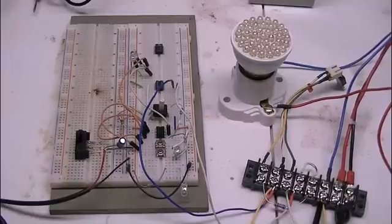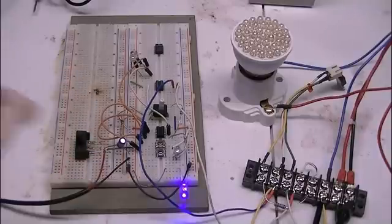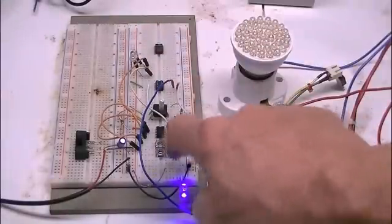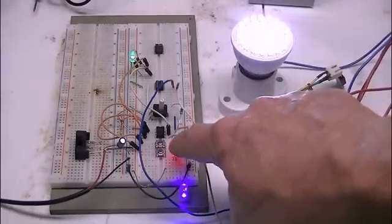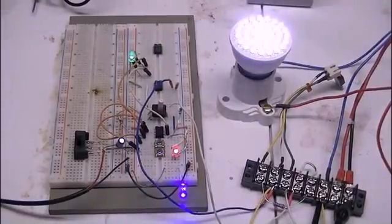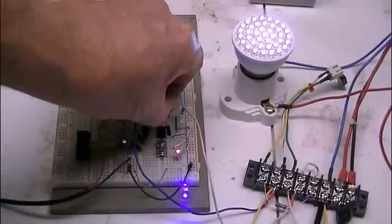Let's give this a little test run just to let you see what it can do. Power is on — you'll notice I've got a little UV LED down there. This is designed to later operate an H-bridge. If you look out here you'll see an LED come on. I'm reading an analog input channel and reading the value on this pot to control the pulse width modulation output. I can control it on and off.